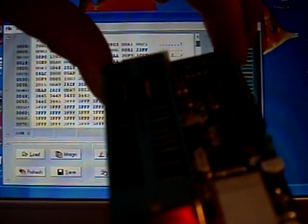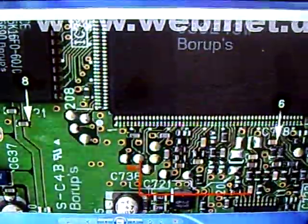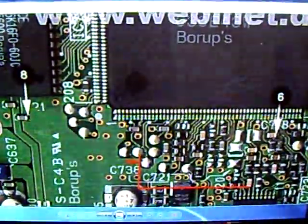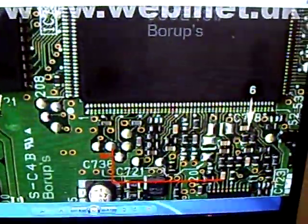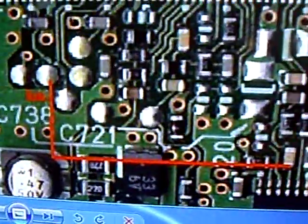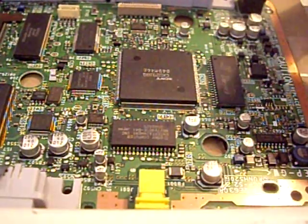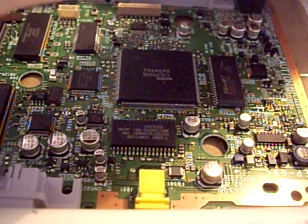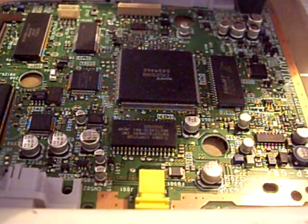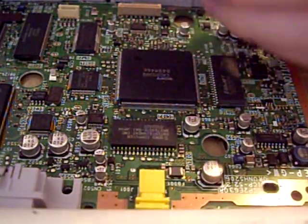So let's go back to the PlayStation and solder in this chip. The install diagram is a very easy install by the looks of it — two wires to the chip, legs six and eight, and then a single wire to jump those two points. Kynar wire with a tiny bit of solder on the end. We're going to solder to this very small resistor, and with our 40W iron which is very hot, I don't want to be on too quick and knock it off the board.